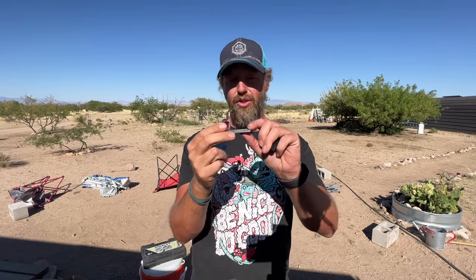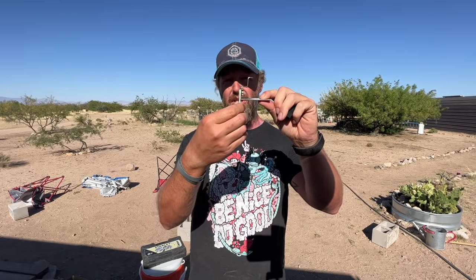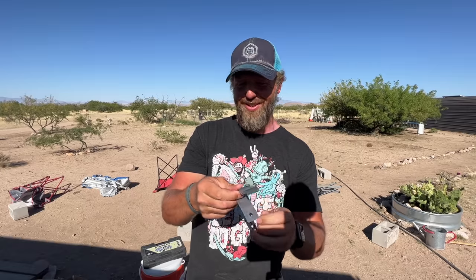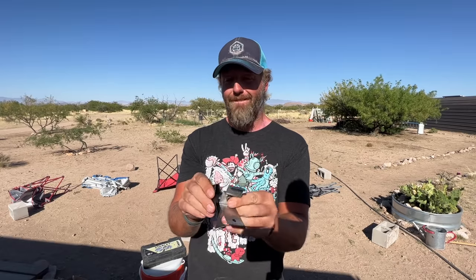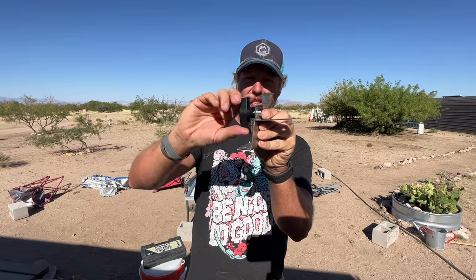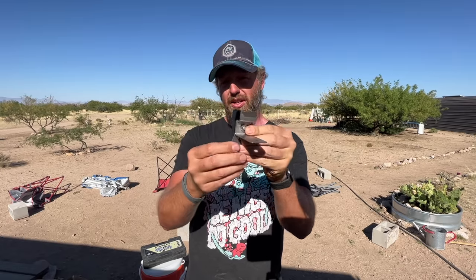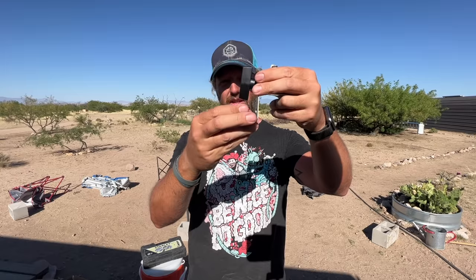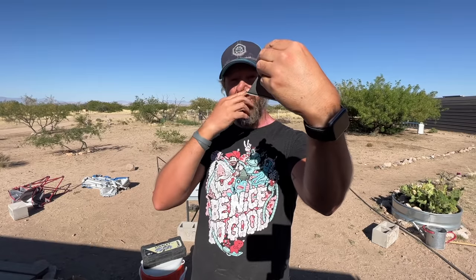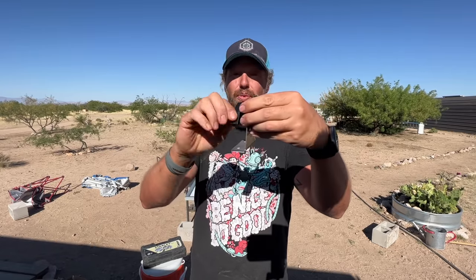Okay, so there's a few pieces to these mounts. So you attach this part to the frame of your solar panel, screw it in or bolt it in through the bottom, and then you attach a foot to the side of it. And the way you do that is there's a knob. Sorry, I got a lot of pieces here. Hold on. So like this, put it in place, and then that way that leg or the foot, whatever you want to call it, is movable so that if you have a pitched roof or a rounded roof, then you can adjust it before you tighten it down.